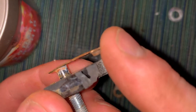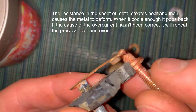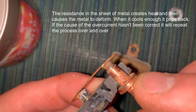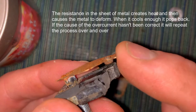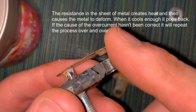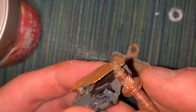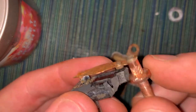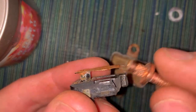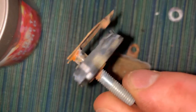That's pretty simple and probably fairly reliable until the contact gets worn out. It does take some heat to do that — and maybe that's why this failed so easily, because it's been hot a couple times. It took about 70 amps for like 25 seconds to blow it, but if you did a dead short it would blow right away, because this is basically just like a fuse that pops back — it's a self-resetting circuit breaker. Pretty cool, pretty simple.